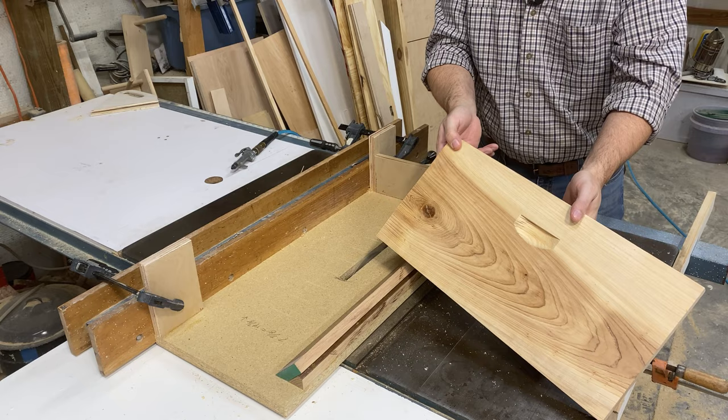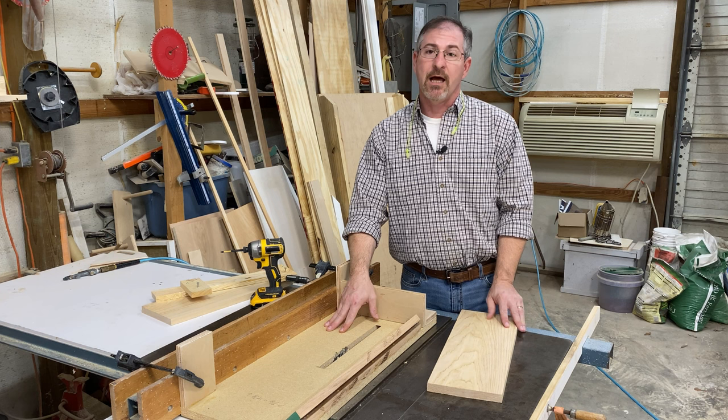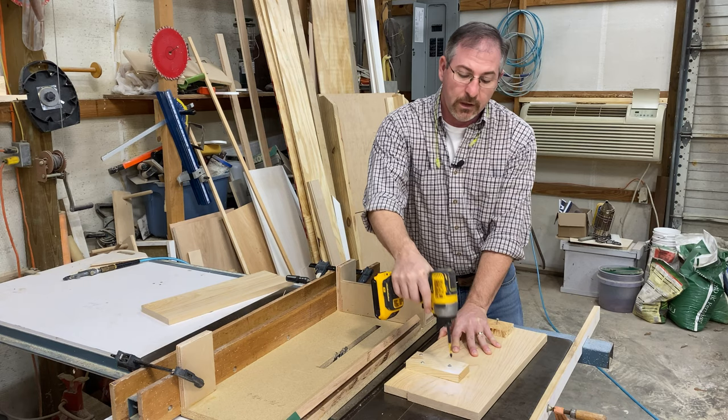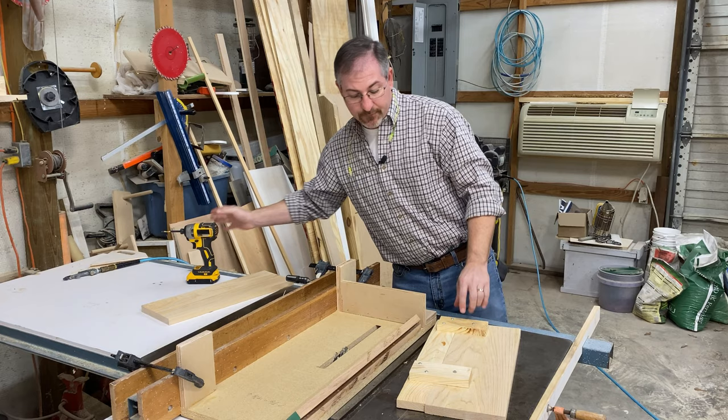You'll remember we made our rips for our medium 7 inches, but our jig is set up for 9 5/8. The simplest solution is to take a 2 5/8 rip and extend the width of your medium. It will leave a couple holes. I don't think your bees will mind, but if you do, you can always put a little putty in the hole when we get done.